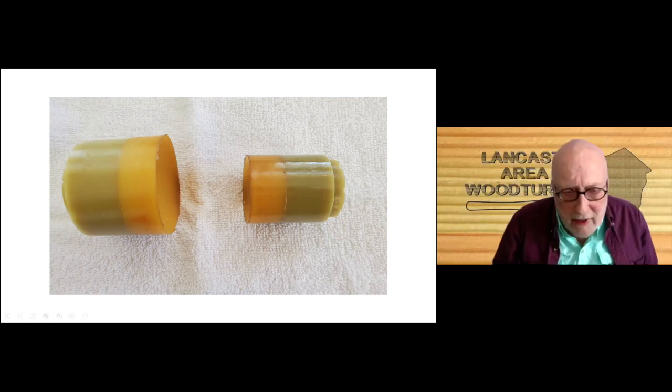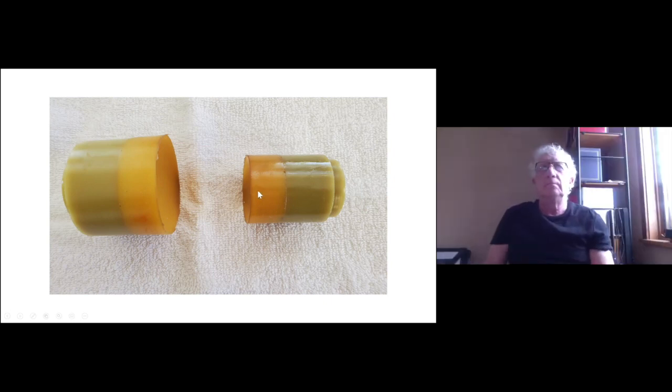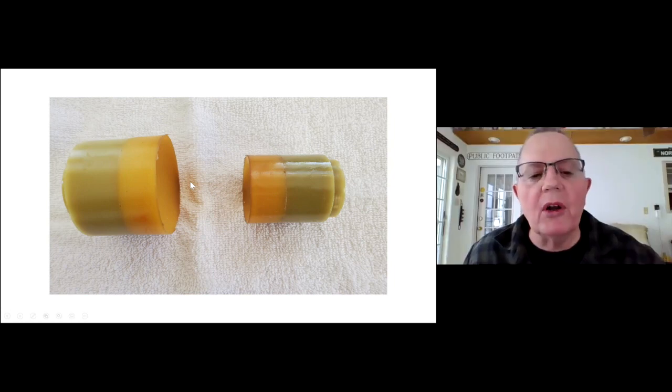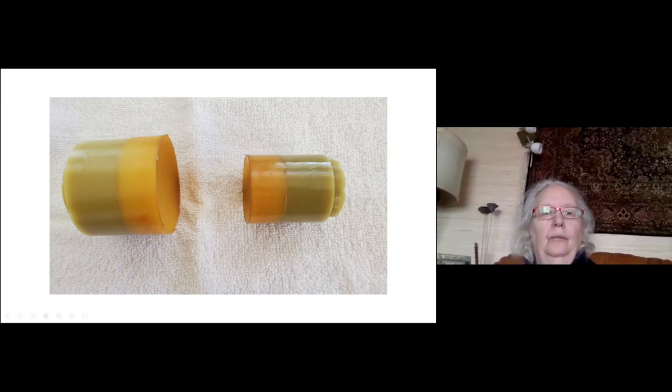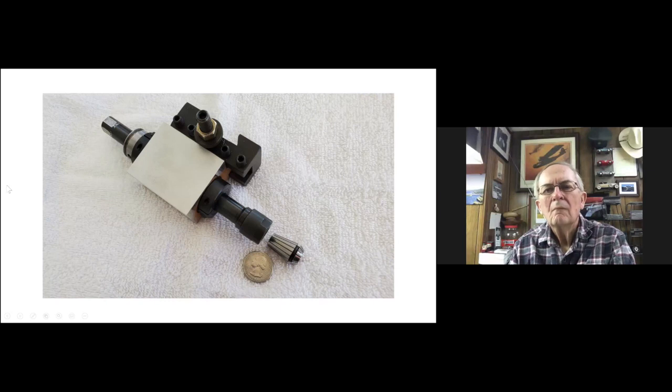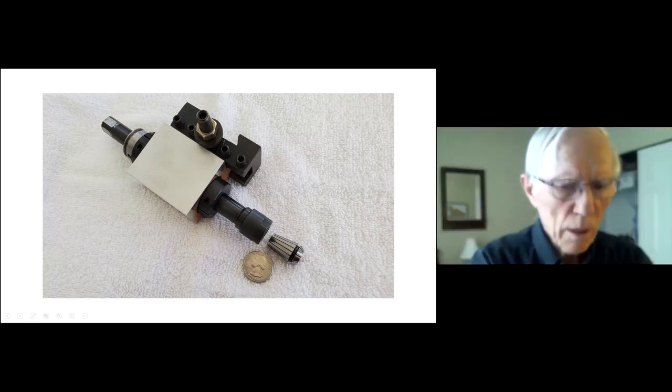What's the material of that? Is it kind of a silicone? No, it's harder than that. It's not totally hard like hard plastic, and it's not really soft, but when you bring it in, it doesn't mark your material. So it lasts. I've had these a long time, and it goes by adapter. This goes on a 3/4 16 adapter, and then the same thing with the headstock. Is that threaded, Ray? Internal thread. Yes. Okay.